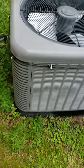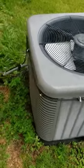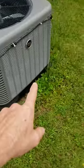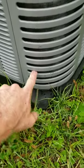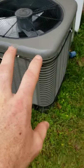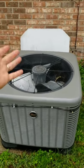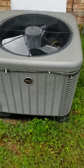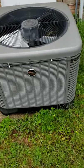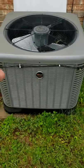The fan out here draws air and water through, and the coils get cooled by this. It's very important to make sure your system is running as efficiently as possible. Make sure all the grass and debris are clear — nothing on the coils — because that'll disrupt airflow and hinder cooling ability. On the inside of the house, the air handler filter that you change out regularly — air flows through the filter and goes through the coils. If the filters have been dirty or neglected, you could be losing 25% to 30% or more of your cooling ability.